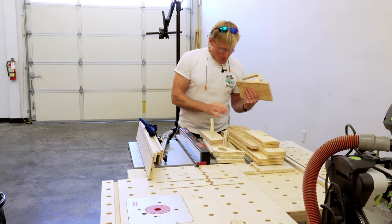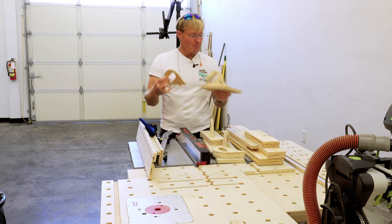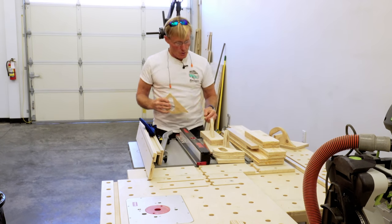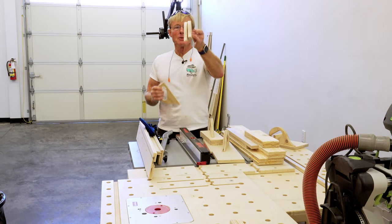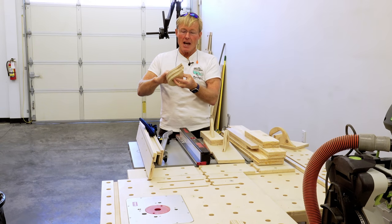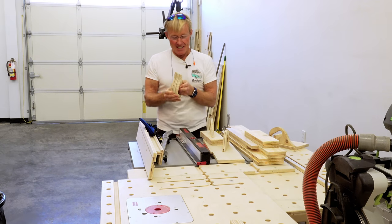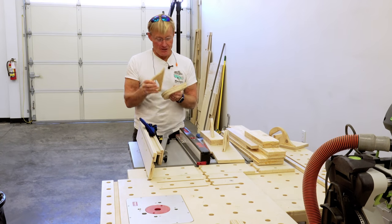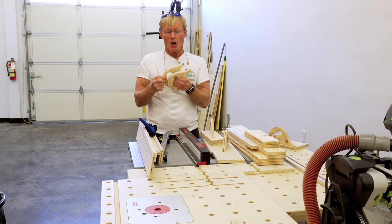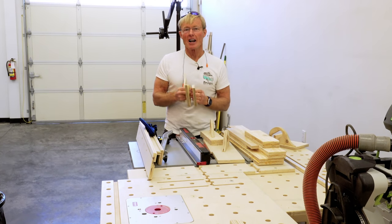I went ahead and traced this handle onto a piece of half-inch 12mm material and made a template. Now I have a little template that I screw down onto 18mm three-quarter inch material. I create a straight edge on it, screw this down, and use my router with a bushing — I've shown you how to use that with all kinds of templates. I use my router and get the same handle over and over again, so I don't have to spend a lot of time worrying about how to make these. As I make more blocks, I'll be able to knock out more handles.